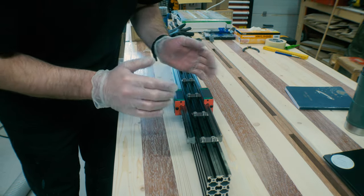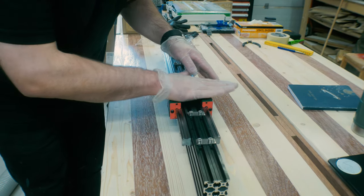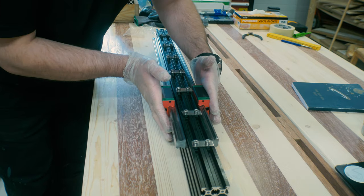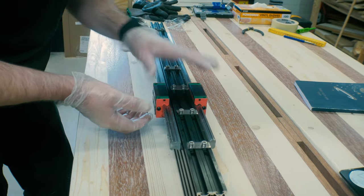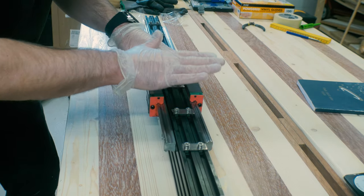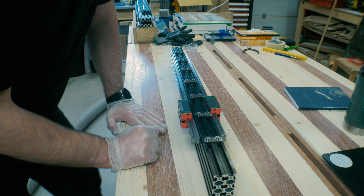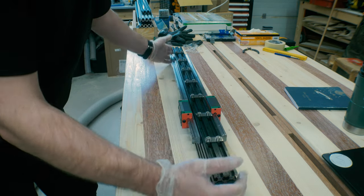I also think I am going to get a weak point where I have to build this bracket with a straight plate on top here and two horizontal plates on the sides here. The joints between these horizontal plates and the vertical plate are also going to be a weak point. And if I was going to do it like this, I would have to machine those plates very precisely, and I don't have the means to do that. That's why I decided to redesign this Y-axis base assembly.